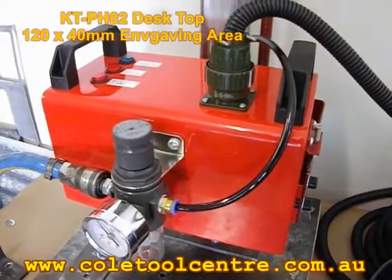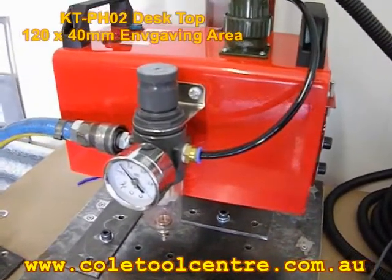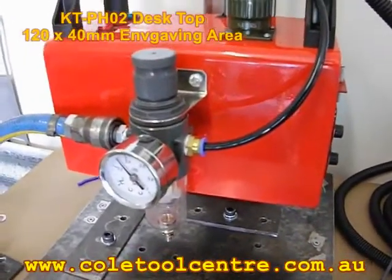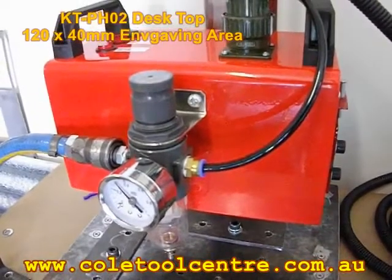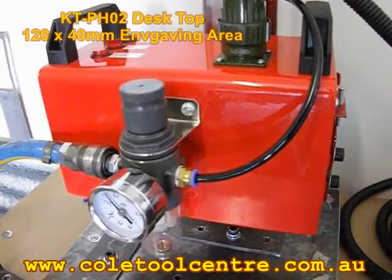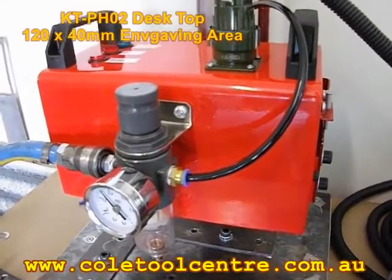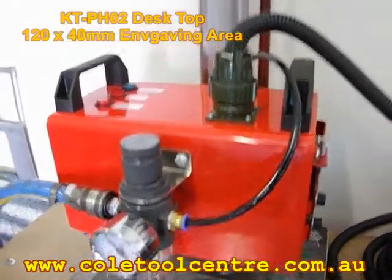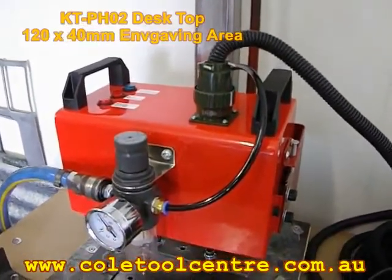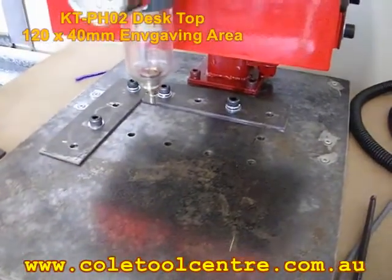Now, after watching my first video, you would notice that we brought in the portable magnetic base type pin marking machine, which I thought was a great idea. But there is an option with them to use it in a desktop configuration, which is probably another great idea, because you can actually have it moving up and down on the desktop onto your product that you're holding solidly in a fixture in the bottom here.